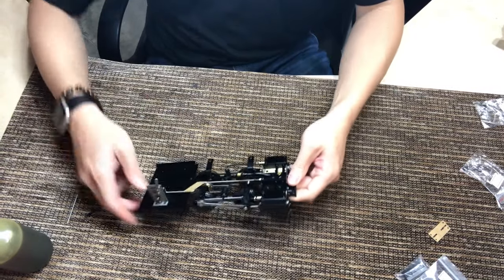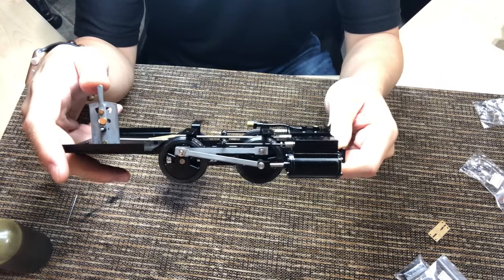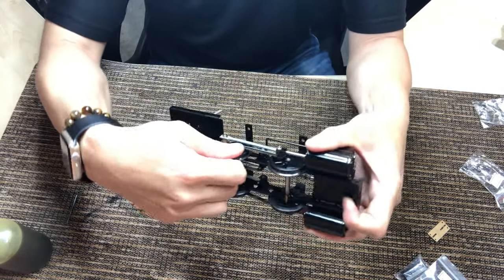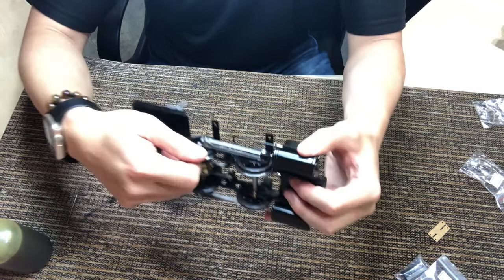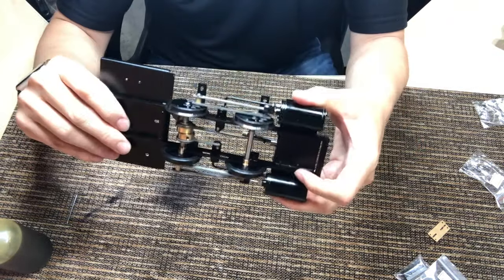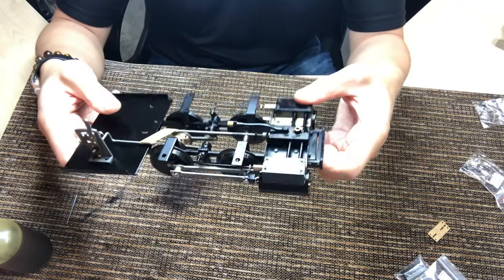One last bit of advice: some people like to time it in reverse for a different kind of steam admission, where forward and reverse are swapped. The easy way to do that is instead of putting the piston in the rearmost position to time the eccentric, you put it in the most forward position and then turn the eccentrics around so they're facing the other way. Do the same thing on the other side. Some people like to do that and think it's more efficient — I'm not quite sure of the mechanics behind it, so if you know, maybe you can put that in the comments.